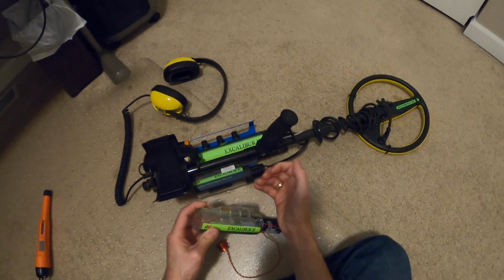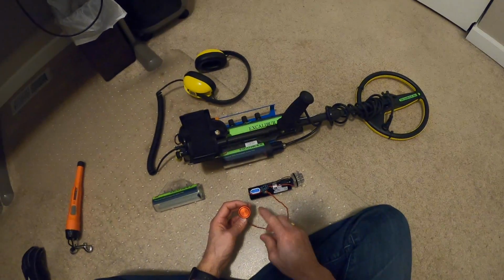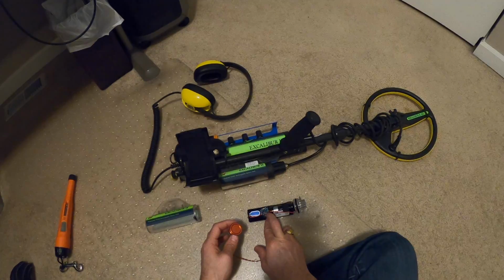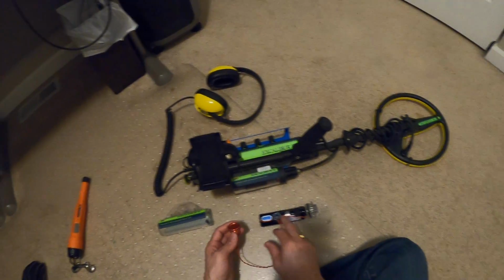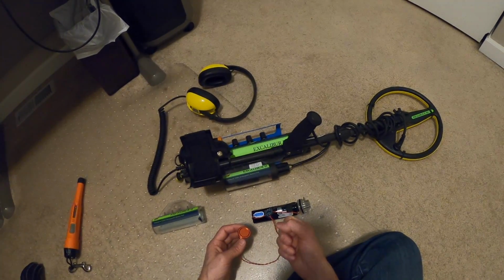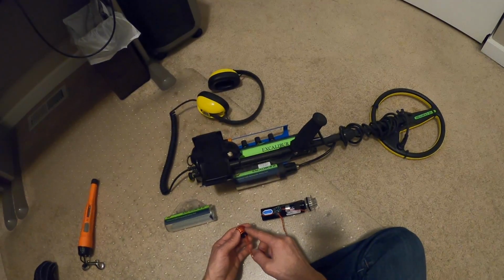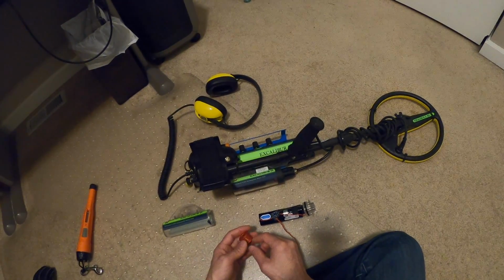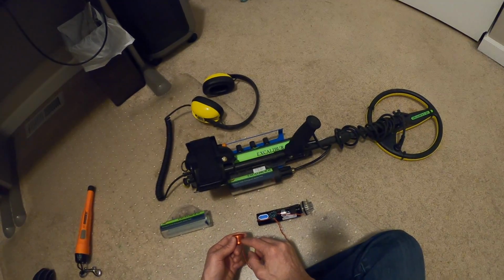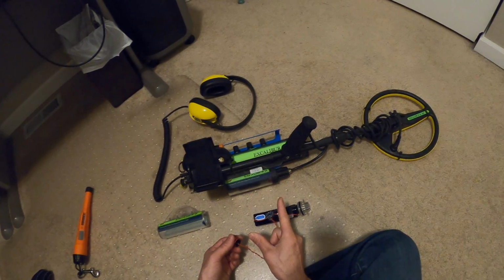12-volt battery pack. I'm going to just bring it out of the case here, basically, and what you have here is a piezoelectric switch, and we have a control board here. But basically, this is a piezoelectric crystal. Whenever it gets flexed or bent, it actually generates a little bit of a voltage, and that voltage can get translated to a contact switch, and that's what we needed. But when you push it, it just sends out a small little voltage, and its internal circuit actually makes it like a dry contact, open and closed.